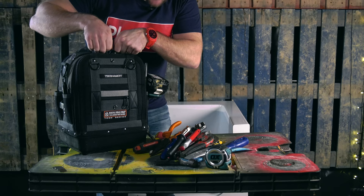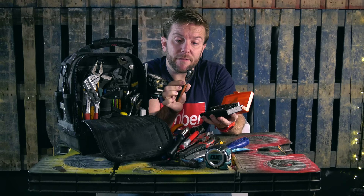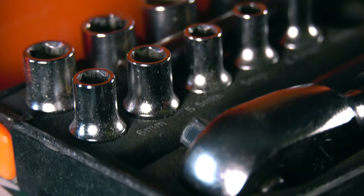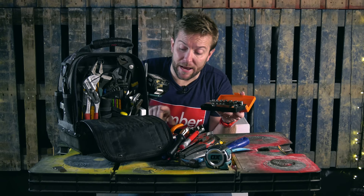Around the other side, number one: this is a very, very handy tool. This is a Bahco small socket set. We've got a very small little socket ratchet here — it goes both ways and it's got very tight jaws with about 40 positions of movement. So if you're trying to undo something in a very small space, you can still get those minor movements. It comes with a little extension and we've got bits that go all the way from four millimetre up to 13 mil — really handy for boiler casings and little nuts. I also added a little adapter so it can fit on my impact driver. This Bahco box stays in here all the time.